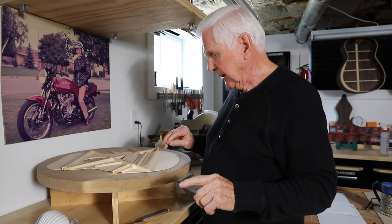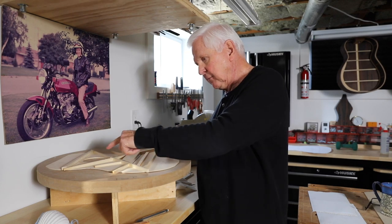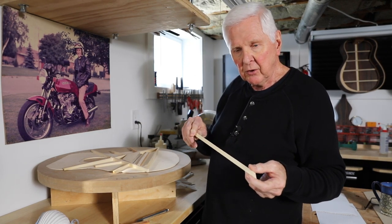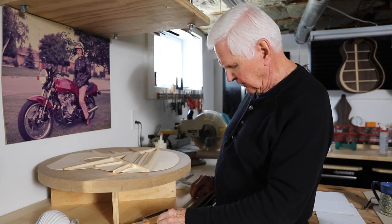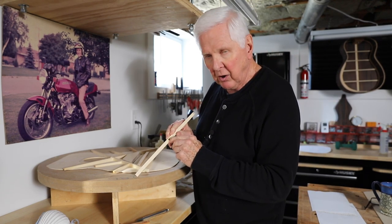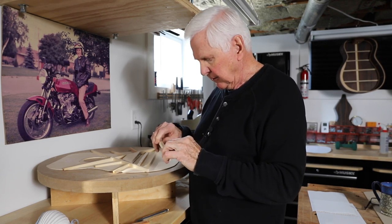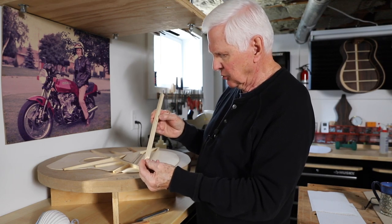What I did to make sure that when I started gluing I wouldn't mess up — I numbered each one of these pieces. Now, one other thing: I decided not to use the curvature on the top; I'm going to use the flat side. I took it to the drill press and drilled a small hole through here — that's where the Allen wrench is going to go through to make an adjustment in the truss rod if I need to.